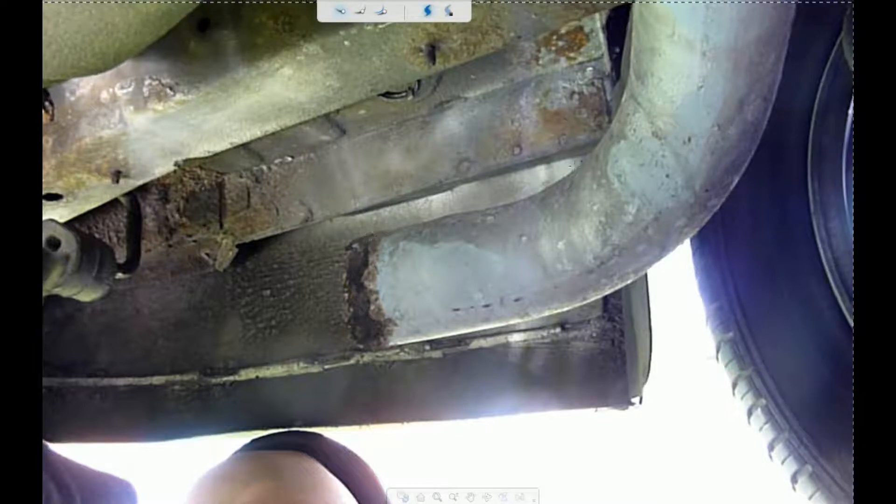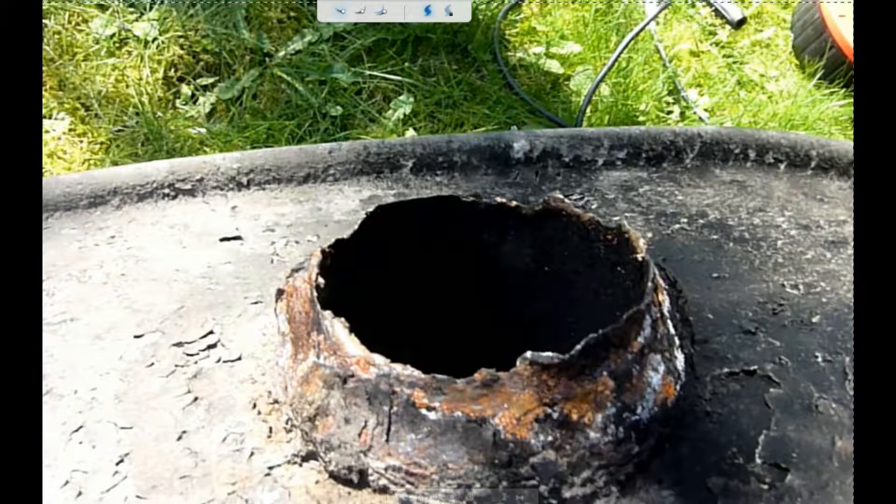When I began, it kind of looked like this. This is the end of the exhaust attached to the car — completely rusted, as you can see. Some of the silver bits are from old paint I sprayed on. The silencer end had completely fallen off. The problem is all this rust needed cleaning off, and after cleaning it was still quite rusty. When I attached the other end of the MIG welder, I couldn't get any sparks — it wasn't conducting electricity because it was so rusty.